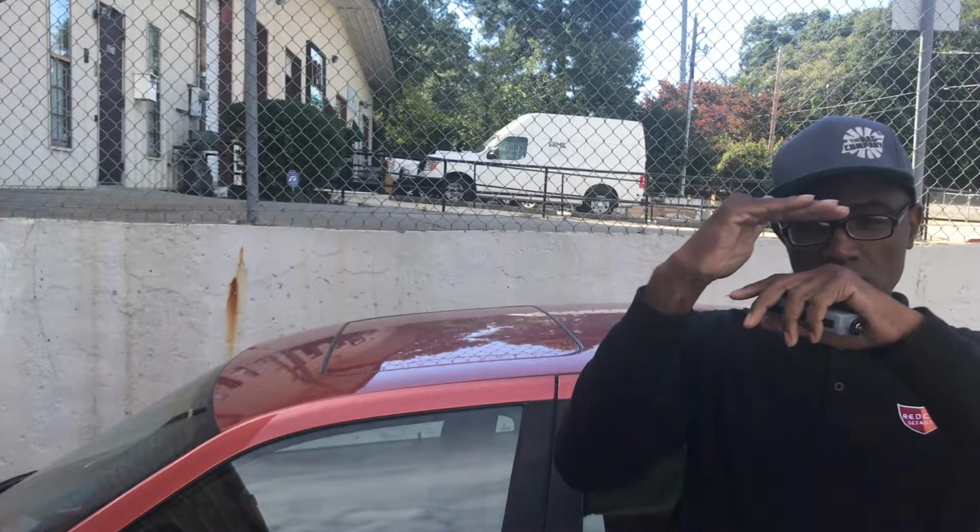So when you're buffing on a car, polishing, sanding, all that diminishes the level of the clear coat. So it's very important to reduce the amount of abrasion that's going on your car, polishing it. Don't get in the habit of just going crazy polishing, because you're actually going from here to like this, just to give you a drastic demonstration. But your paint is going from here to down as you continue to polish on it and sand it and things of that nature. So you want to be very careful if you don't have a meter and don't know how to measure it, or you hire a detailer and they just go crazy buffing on it and they don't know how much paint you got on it.